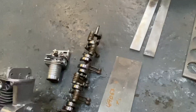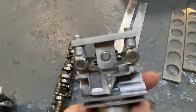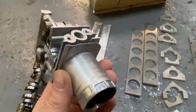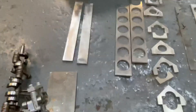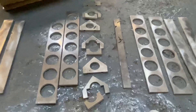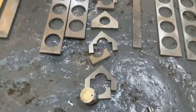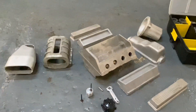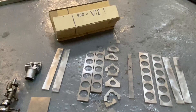I've got lots of these engines — I think I bought 22 engines — so I have a lot of parts I can use. These already have valve guides, rockers, and a single camshaft; it would be an overhead cam as opposed to a pushrod, which is not so scale. These are rated at 1.2 brake horsepower each and have quite a lot of torque; they take a standard-size plug and have inserts for the inlet and exhaust. The bore is 35mm and the stroke is 26mm. So I'm aiming back towards fewer cylinders — a V8 using these bits. That's a bit of V12 revisited, but also to be resurrected for the Cobra.